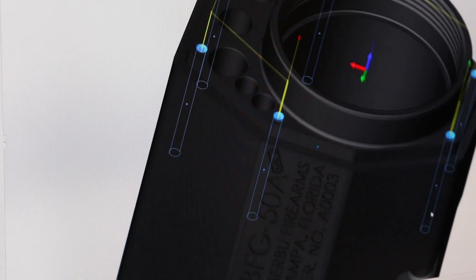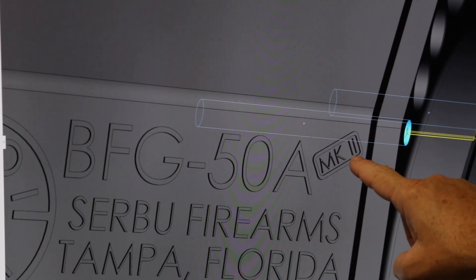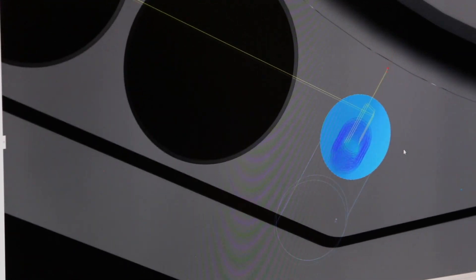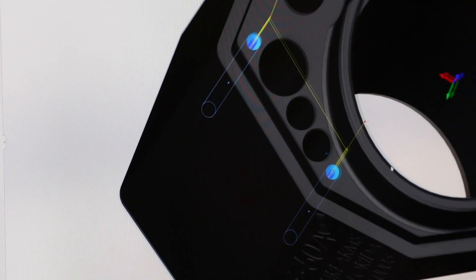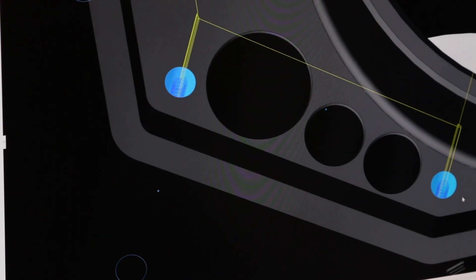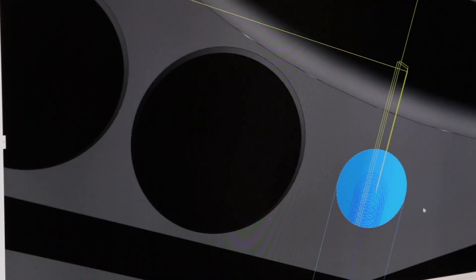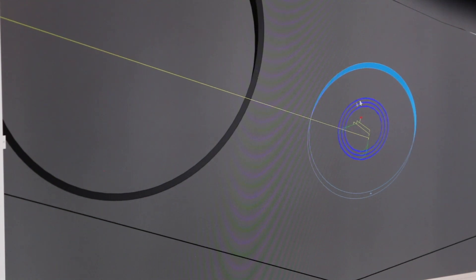Okay, so here's the trunnion — it's the Mark II. It's got the threaded holes for the spokes. If you look, they're actually really tiny, you know, they're bicycle spoke threads. For those of you who know this sort of thing, the minor diameter of the thread is 0.078 inches and then the major diameter is just around a tenth of an inch, 0.1 inches.